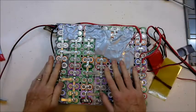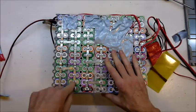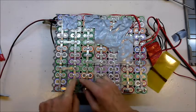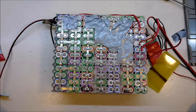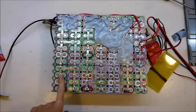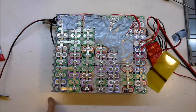My plan is to replace one of these with a new line, a new strip off to the side, insulated from those, and then connect everything by fuse wire. Then I'll test the battery with a heavy load to see whether the fuses blow or not. And if that works on this pack — I'm just going to do one line — then I'll use that fuse technique on the 2kW pack.